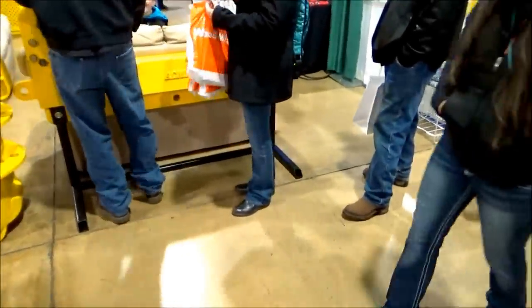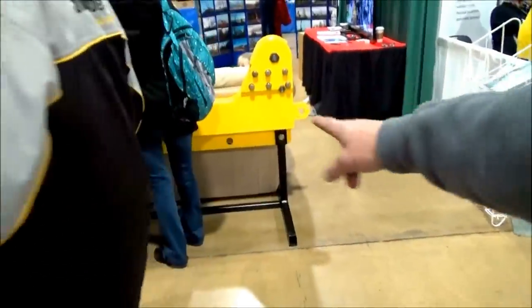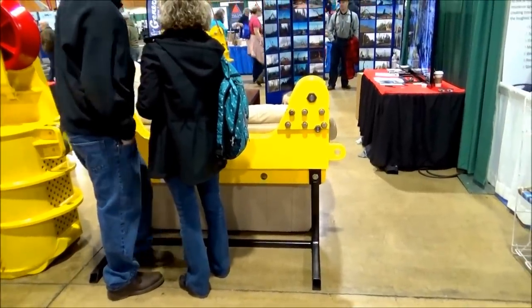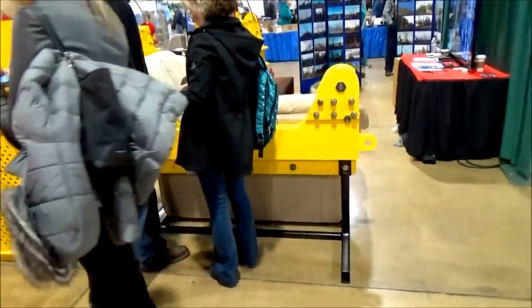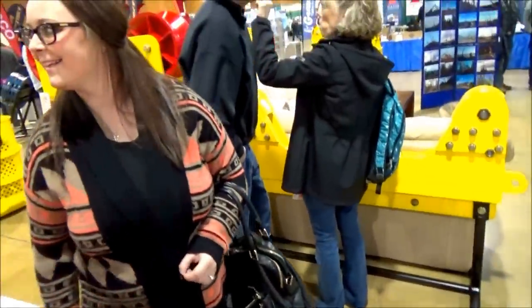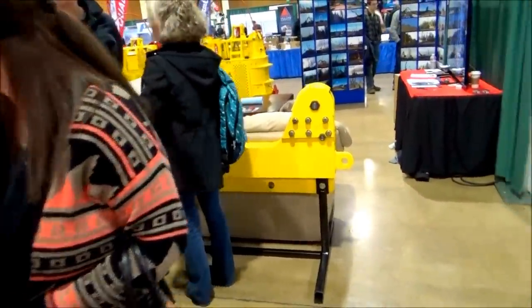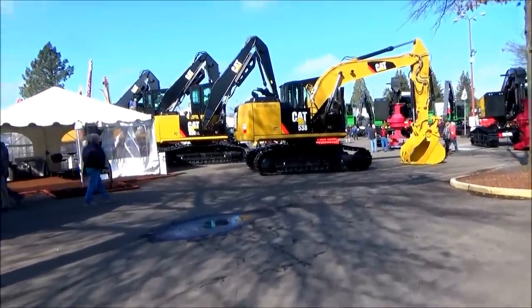Now they're even making a drifter for in the summer when the heat shuts things down. You just hang three chokers on it, like 40-foot long chokers, with one of them holes, and it's what they call a gravity carry. You just gravity it back and slack the skyline down, set your chokers, pick it up, and bring it in. Because when the heat hits, like a 1 o'clock closure, we can't run them because they throw sparks. Like a twin disc clutch or Harley Davidson or something. They're just paying for that name.